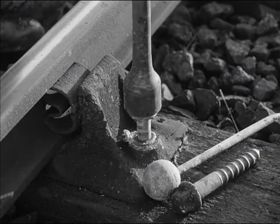All these faults can occur in either straight or curved track, but curves have problems of their own as well. On any curve the outer rail must be higher than the inner rail by a definite amount called the amount of cant. This is measured in inches and fractions of an inch. The proper amount of cant is stamped on monument blocks in the six foot. Here too is the scribe mark which is used in checking the alignment of the curve. Sometimes the amount of cant is shown on cant plates fixed to the sleeper. Bob's gauge has a spirit level and the position of the bubble tells him the actual amount of cant. If there is too little cant, void meters and sighting boards must be used to determine the quantity of chippings needed to restore the outer rail to its proper height. The number of canisters of chippings required is chalked on the rail at each sleeper.